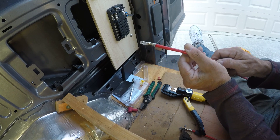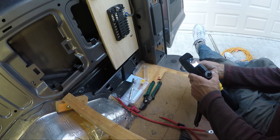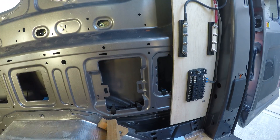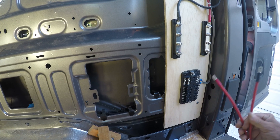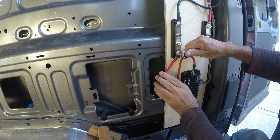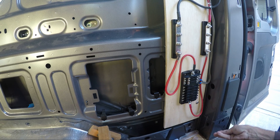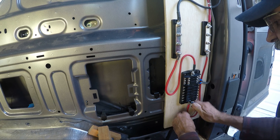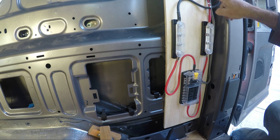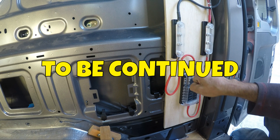That's a great connection. I cannot emphasize enough how important it is to have a good cable connection. So I've got a positive and a negative — that's a negative, that's a negative. The positive and negative come in to the bus bars; from here it goes to batteries, which I still have to install. And then it also goes to a fuse box.